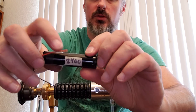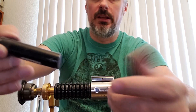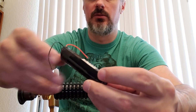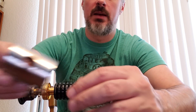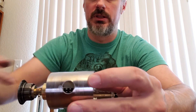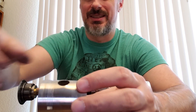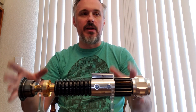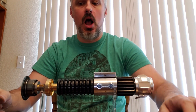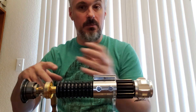This was the battery that was in there — it says 2400 on there, which I can only assume means milliamp-hours. Again, wrapped in electrical tape. I haven't taken it apart yet to see how good or bad the soldering may have been. The clamp was drilled through, as was the inner body, to put a 12mm offset recharge port on the outside that was sticking out pretty badly and wasn't centered. Just in general, a very, very bad install.